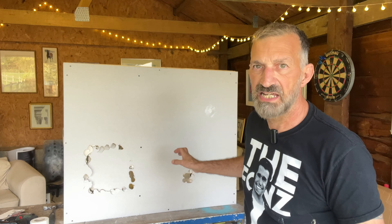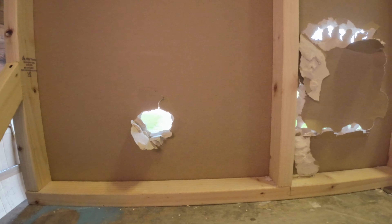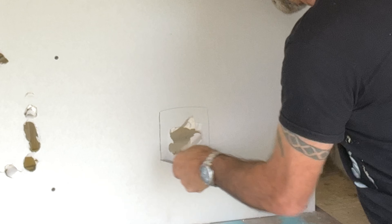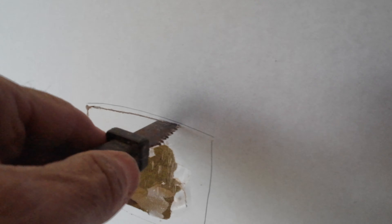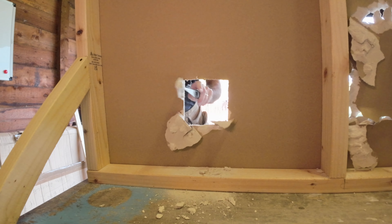So we are going to look at this medium hole here. You can get your hand through, and if we look around the other side, the timber studs are nowhere near — basically we feel like we're fixing into mid-air. So I will create a kind of square; it doesn't have to be that accurate. Next we are going to be using our pad saw, which is a very useful tool. It's got a pointed end — you can just push it into the plasterboard and start cutting along your line.